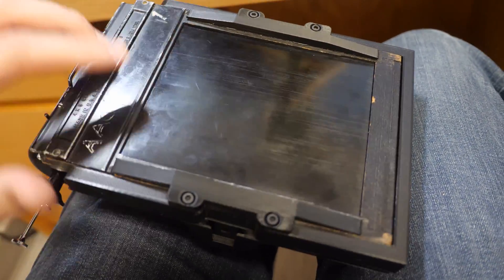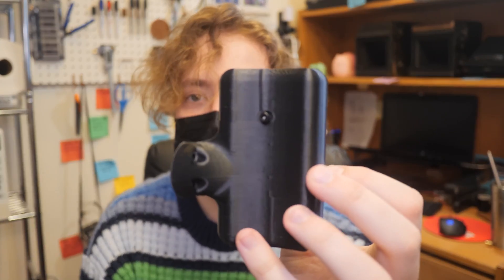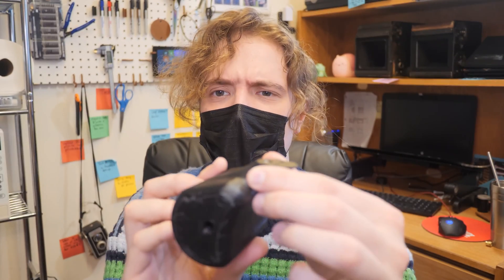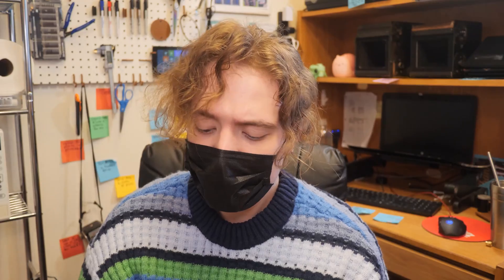So another thing I figured out around this time was a handle. The camera has these little threads and it allows you to go around portably. I really don't like how it looks — it's very bulbous. It has some cool features: if you have a camera shutter release cable, you can thread that through here, and it even has a screw to retain the cable in the correct position. 3D printing has pros and cons — one of the cons is that the strength of a part depends on the orientation in which it was printed. The result is that the connection to the camera is one of the weaker parts of the handle, so I created a thread for a screw that goes through the body of the handle, and I think that's worked pretty well.